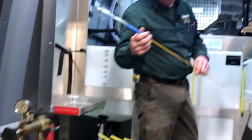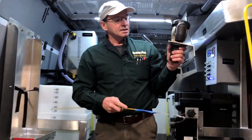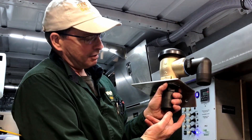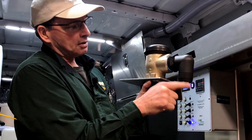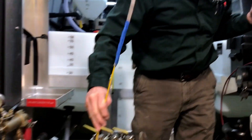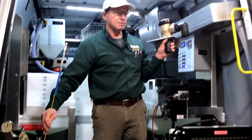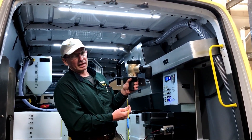The difference with the brass air gap system is that this will come from the hydrant, garden hose, stream pump, or whatever — it will come up into here, come out here, and then go directly into the bottom of the suction manifold, and then you can distribute it to any tank that you want. So that's the difference between the brass air gap system and the top fill air gap system.